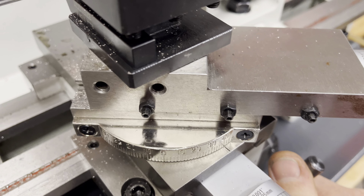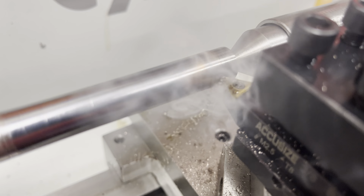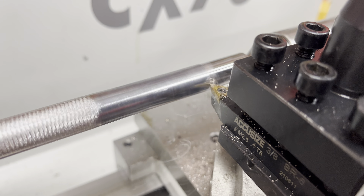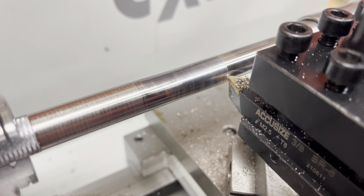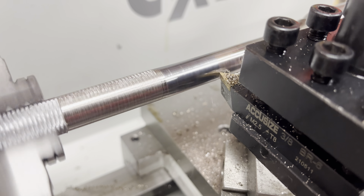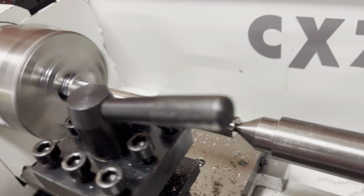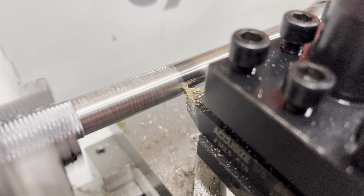Let's go to 20 thou here. I'll use the auto feed so I can video. This should be tool steel — I cut off an old socket ratchet I'd had, a really cheap one, for probably 20 to 30 years. We'll find out. Cut some of the knurling off here.